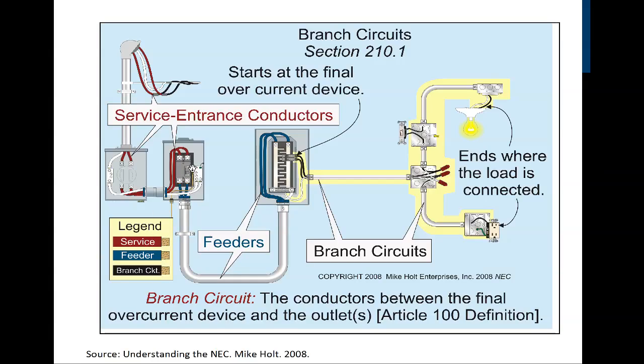So this is my main circuit breaker. In this case, they have it feeding this feeder box, and here we have the separate circuit breakers like we'd seen before. This gives us an idea of how this top circuit breaker that's shown here is connected to this side. Notice every other one is tied to the left side, and the opposites are tied to the right side one. And what we have here is 120 volts going into this circuit for this lighting, and 120 volts going into this circuit for this outlet. Each one of those is on a separate branch circuit breaker. Notice they share a common neutral wire. So that wire isn't switched, right? The white isn't switched. It's tied here, and then through this bus bar on the bottom, that bus bar ties it back to here. And again, we also put the ground lead in there. So that's what we have.